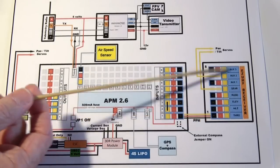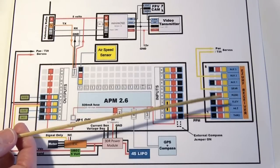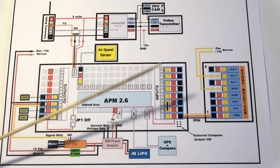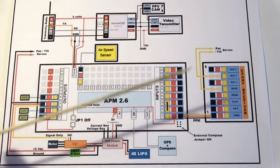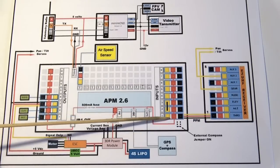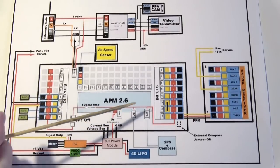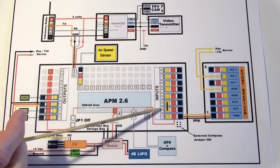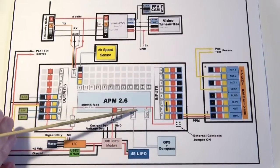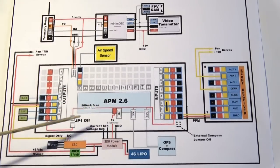This is actually my EZ UHF long range receiver. You may want to use some other long range receiver like the Dragon Link or the OpenLRS. I wouldn't recommend using something short range with a Mini Talon because it can get out of range and you'll lose it. They even have a Nano EZ UHF out now. It's going to connect by PPM through one servo cable to the bus. You have to put a jumper on signal pins 2 and 3 to enable PPM mode, then connect PPM on pin 1 from port 1 of the EZ UHF.